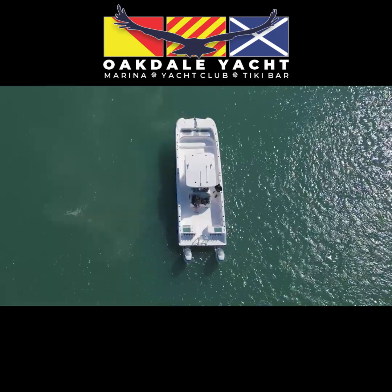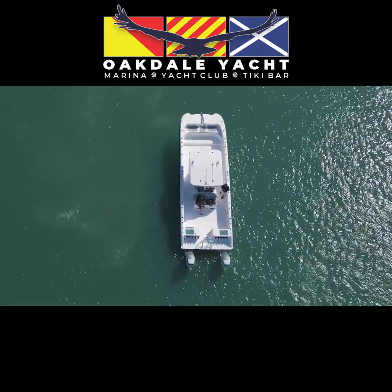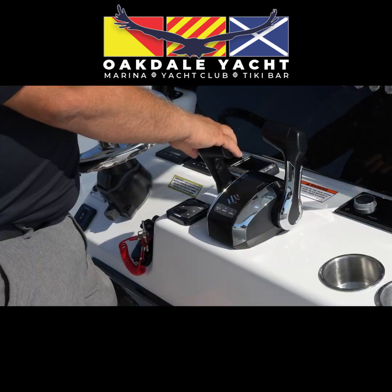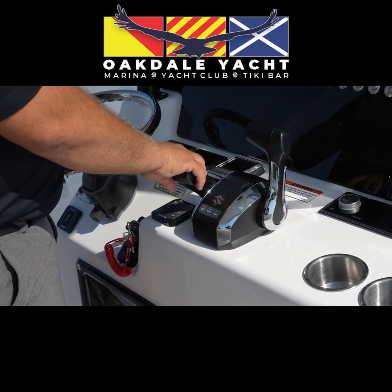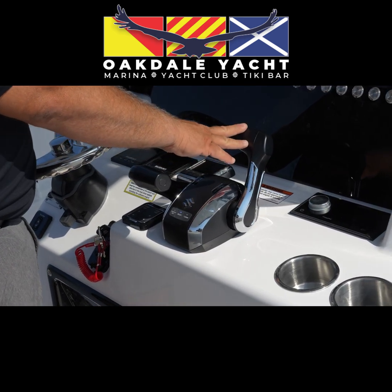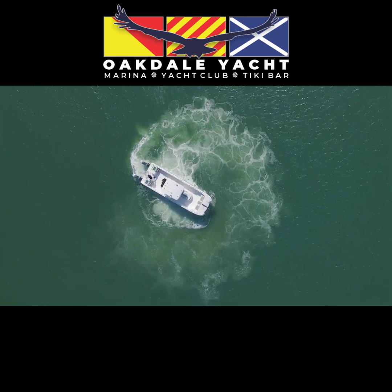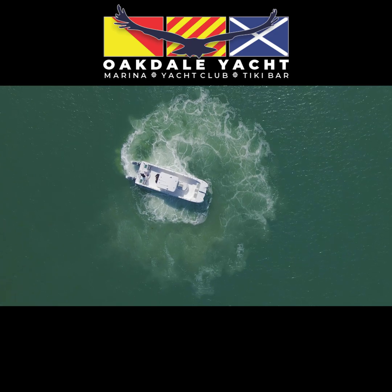One of the major advantages of a Twin V in maneuvering is that the motors are very far apart, which allows us to spin the boat basically on a dime. If you'll notice, I'm going to put the port motor or left motor in reverse, the starboard motor or right motor forward, and this is going to allow me to spin the boat basically in place without having to use any of the steering wheel at all.